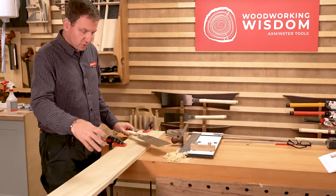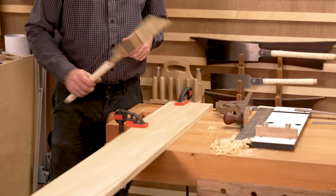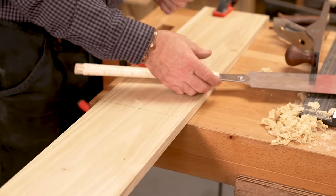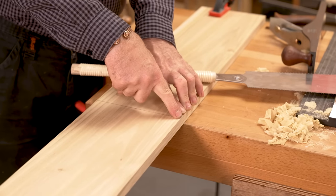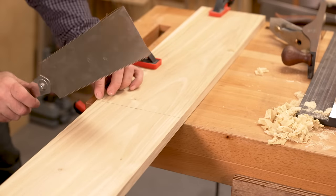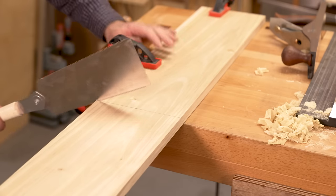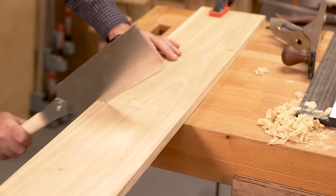So I think if we get you in just a little bit nearer, we're gonna get you just to focus on it. Let's try and explain this and what we're doing. Be interesting to know if we asked you where you're gonna start cutting with this. Most of us, if we had a traditional Western style saw or been trained up, I'd probably start at the back corner and push and try and cut. The Japanese would actually start here. Near corner. Right. More in line. And they pull down.